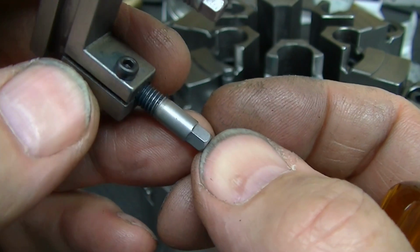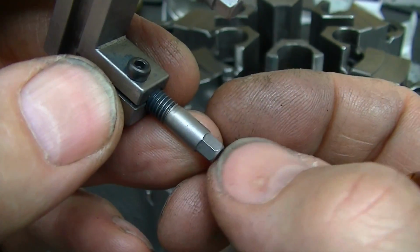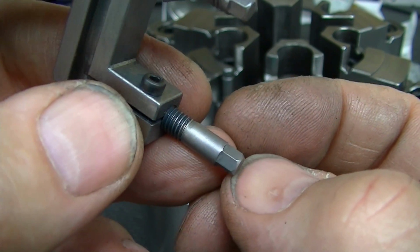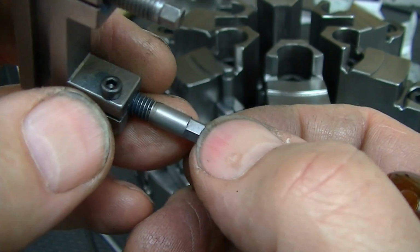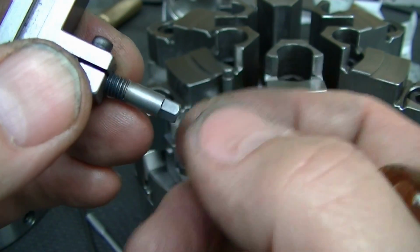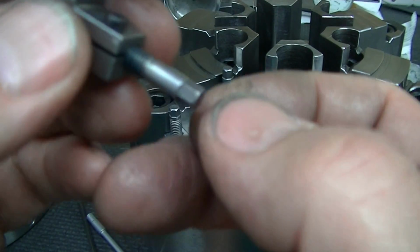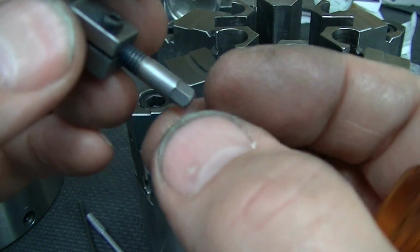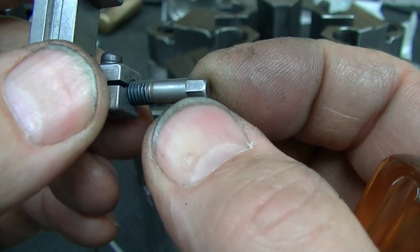Another thing to keep in mind when you're using these materials, Caseonite or the Cherry Red, it takes time for that stuff to infuse the carbon into the surface. So if you just dip this thing and hold it red for a few seconds and quench it, the depth of case that you get on there is going to be insignificant. So you actually need to hold these for a while and give them a good 5 minutes of dipping them in the material. It gets into a thick, lazy stuff and it drips off, and you hold it on there for a while such that you actually get a case that actually does something.